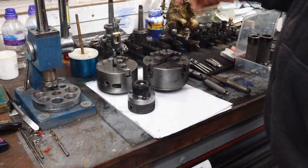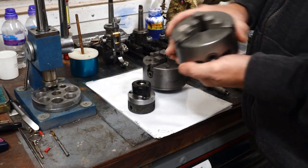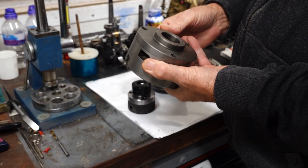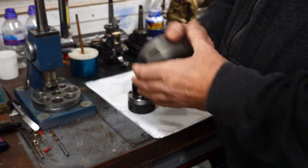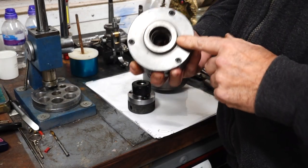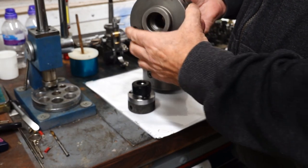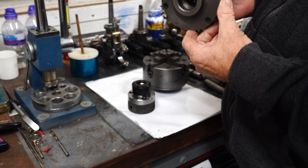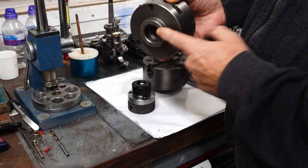So your basics - a three-jaw chuck is obviously a must. If you only had a four-jaw that would be fine, but a three-jaw usually comes with a machine. On my particular lathe it screws on and indexes in here - it's a screw-on chuck, so you can run it in reverse but you can't actually turn metal in reverse or the chuck would unscrew.